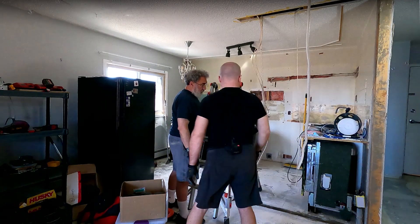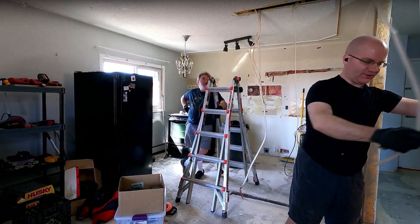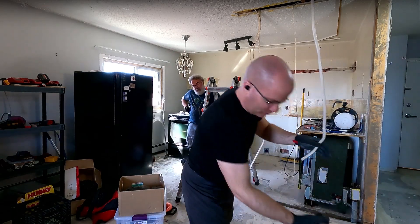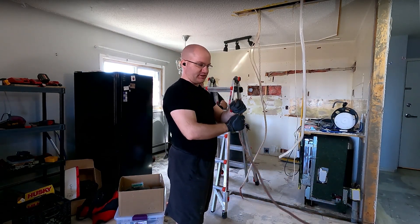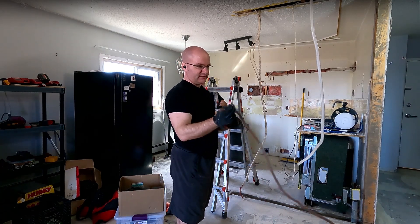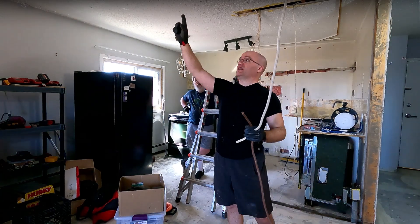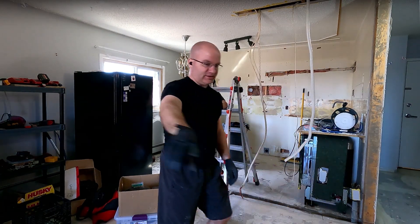We're not sure which cable is that switch. We're going to try to get this brought in over here and make sure we have power to those outlets. Those were probably on a lamp switch, and that's why we have the 14-3 here. We're going to open those up and make sure they are just live. I want this to control another light up in the ceiling, and then I don't need those lamp switches.